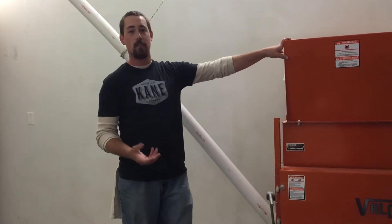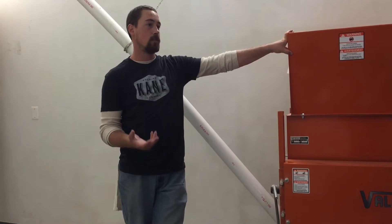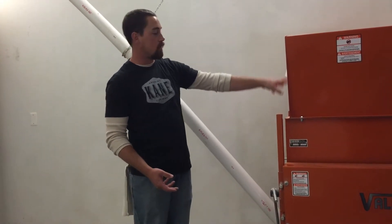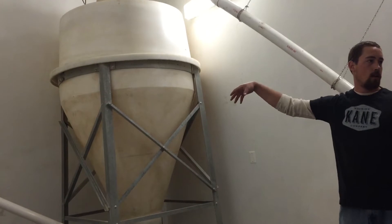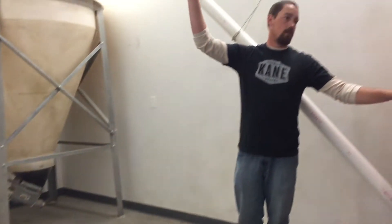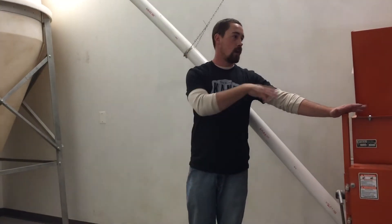The purpose of running the grain through the hopper here is to crack the grains — they crack the grains to expose the starches that are inside. During the mashing process, the starches can be converted to sugars. Once it's through here, it's going to bring it up through this pipe. It causes the grist to fall behind it. From there, the brewer's ready to mash it. It'll turn on the secondary auger and it goes through the wall and up over the brewing vessels right into the mash tun. Once we have all our grain into the hopper, we don't have to worry about any more heavy lifting.